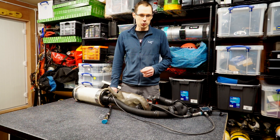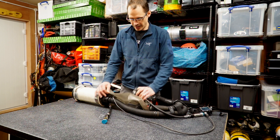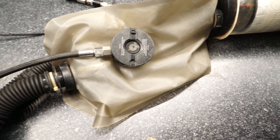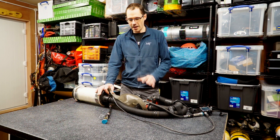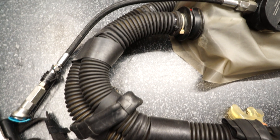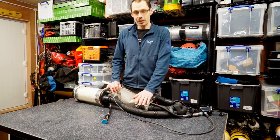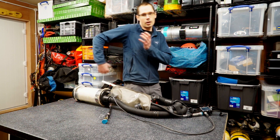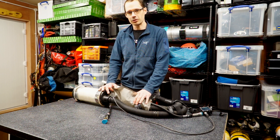Now let me talk about some of the choices I made in putting this together and the gas flow. The first thing you'll probably notice is that the unit only has a single counter-lung. I've been diving and building custom rebreathers for a few years, and all of them have had a single counter-lung, so I'm reasonably happy with that choice — it's allowed me to keep the rebreather quite small and compact. With a single counter-lung I needed to decide which side of the loop to put it on. A lung on the exhale side can be a good water trap, but a long thin lung lying along your body in a sidemount configuration won't necessarily act as a great water trap — so marginal advantage to doing that.